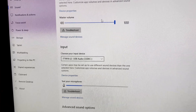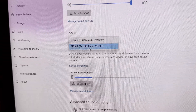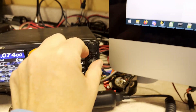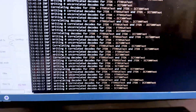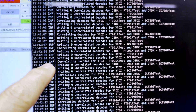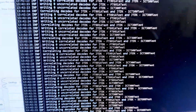To make sure the volume coming in from each device is right, I have set them both to 55 on the computer. The RF gain is maxed out on both radios. This software running on my computer is comparing the output of one WSJTX to the output of another WSJTX to figure out what each radio is doing. So far you're not seeing much difference - once in a while you'll have a few contacts that show up on one radio and not the other. This has been running around 24 hours. I'm going to stop this and start getting some data for you.